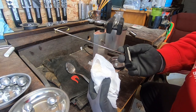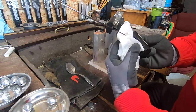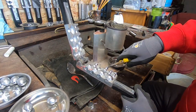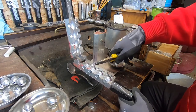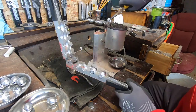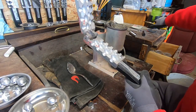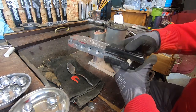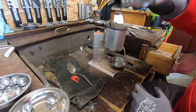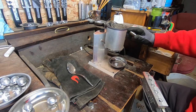On the pin that you put through the mold, some guys will take a little bit of oil on a piece of rag — you don't need much, just a little bit. Every few pours you can put a little oil on that to help it release. Now we got that lead — we're going to pull that. The mold should be good enough. We'll put that excess lead back in the pot; you can do it now or later, it doesn't really matter. Now we're ready to roll. Make sure you hear a good snap and make sure it's in the slot all the way through to the end. Got a little bit of lead hanging off the sprue, so I'm going to put a little there.